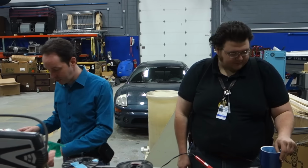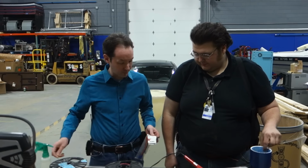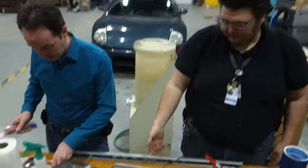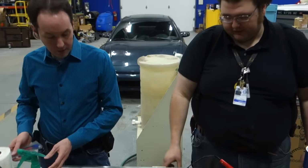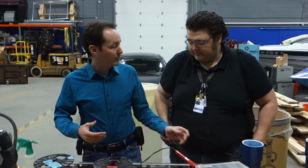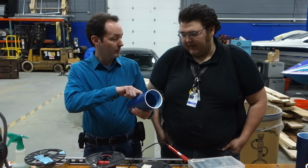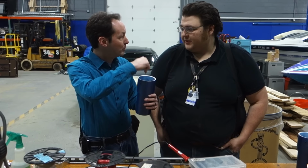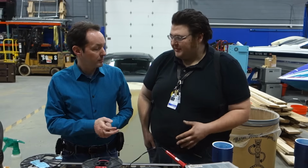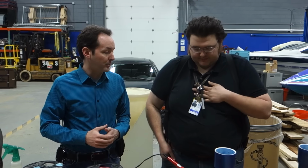So this is what we got. I'm going to begin by putting the batteries on. You should begin with fundamental assembly. This looks like a longer bar. I like the longer bar. This was just a cutoff that just so happened to be the right, longer length. Here are some design notes as you begin. The ESCs require being in a breeze, so I'm thinking we mount the ESCs in the tube, which guarantees a breeze to cool them. The air goes through the tube. It's not a heat sink, I know. I'm worried about the plastic melting if it's not getting enough breeze. Plastic's cheap, we can make another one easy. Let's give it a shot. I don't think they'll get hot enough to melt the plastic.